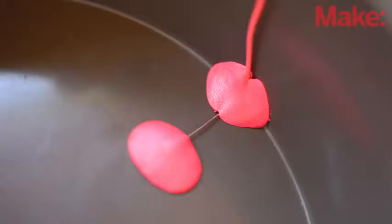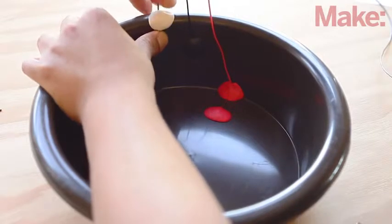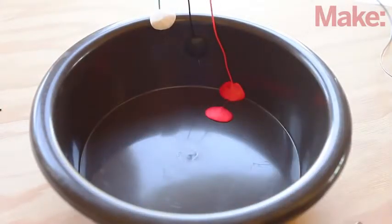Strip a few inches of insulation off the base sensor wire and attach it to the bottom of any non-conductive water bowl with some Sugru. A bit of exposed wire should lie flat on the bottom of the bowl. Next, attach the low and high level probes to the side of the bowl with additional Sugru. Keep them clear of the base probe so there's no danger of accidental contact. The water in the bowl completes the circuit between the base probe and the low and high probes, which allows the Arduino to assess the water level.